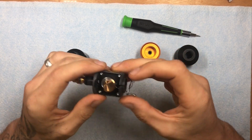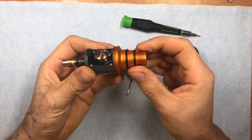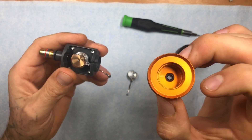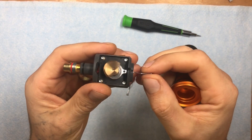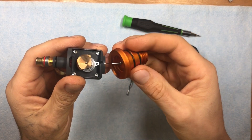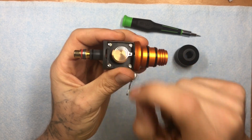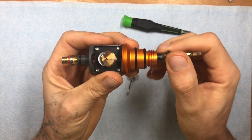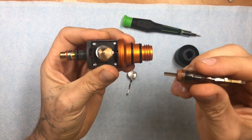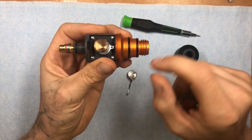This is the original setup, other than the modification to the RCA — this is the way it comes, this is the way it sits in here. Just like that. There is no spring in there and there's no spring in here. When this is spinning around it's just going to stop where it stops. There's nothing that returns it. The only thing that returns this back to top dead center after it's been spun is a cartridge — the resistance and return spring of the cartridge. So this machine has no return spring; it utilizes the cartridge as the return.